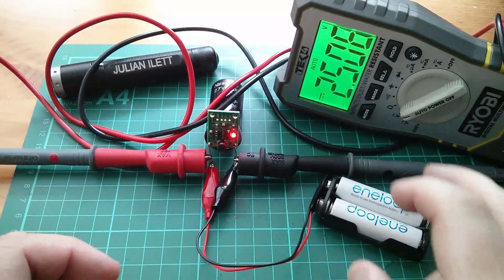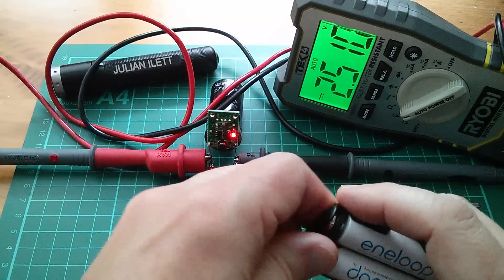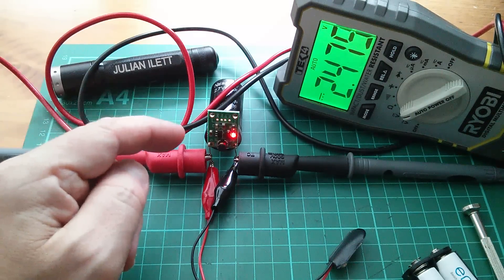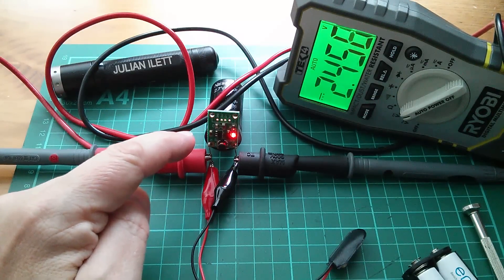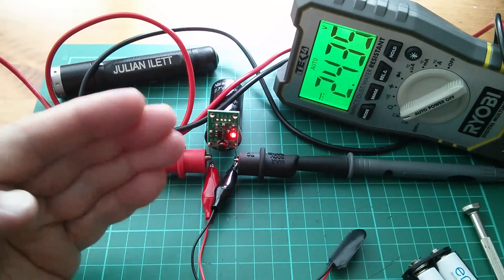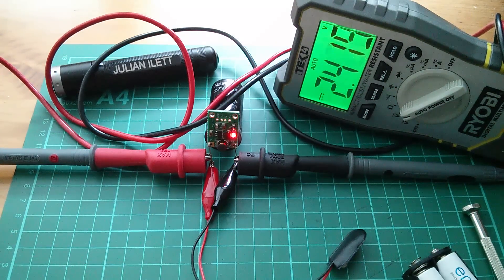There's probably not much point going much further — it'll be very slow. So I'll take this off and we can see how quickly the voltage starts to drop with the LED as a load. Also that high-frequency ringing is a mechanical vibration in the inductor — that's actual physical movement, consuming some power. These boost converters are of course not 100% efficient, so it's dropped back to 2.4 volts now.